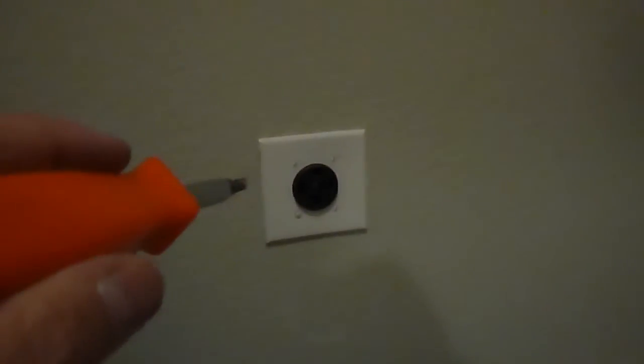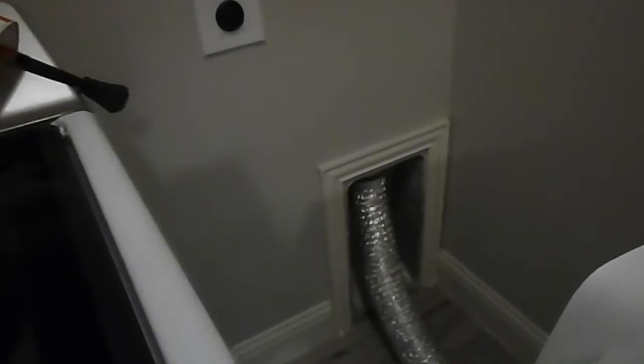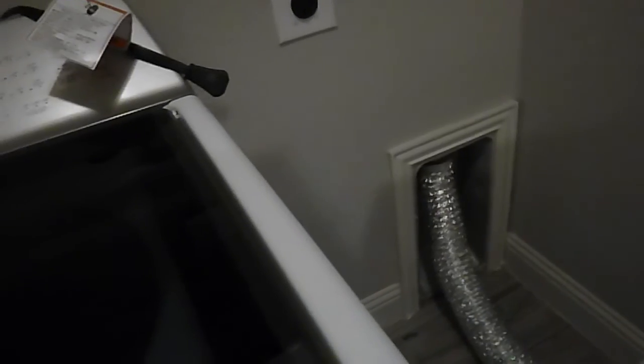Laundry equipment is beyond the scope of the inspection. I haven't checked this outlet for power yet, and I haven't checked this one for GFCI but I will. This closed-door dryer vent going up through the ceiling should have been labeled — there should be a notice stating its length, and there isn't one.